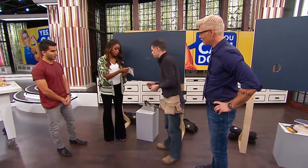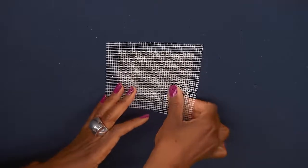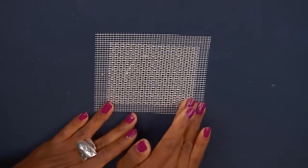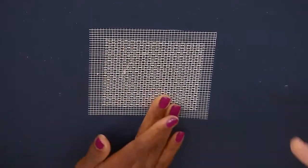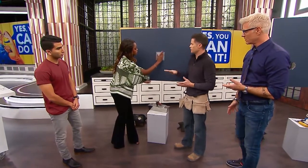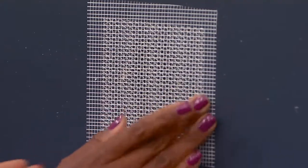Now you want to peel off the adhesive backing. This is super simple. Stick it on there so you cover the whole hole. You could just start putting compound in there — that's another option — but this patch kit gives it more strength. It has a wire mesh that we can plaster over.